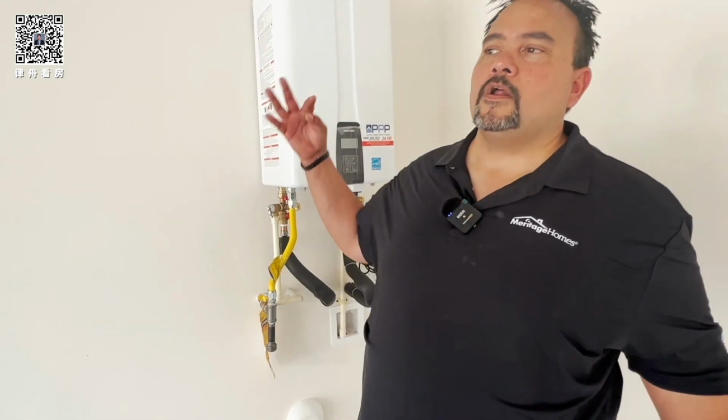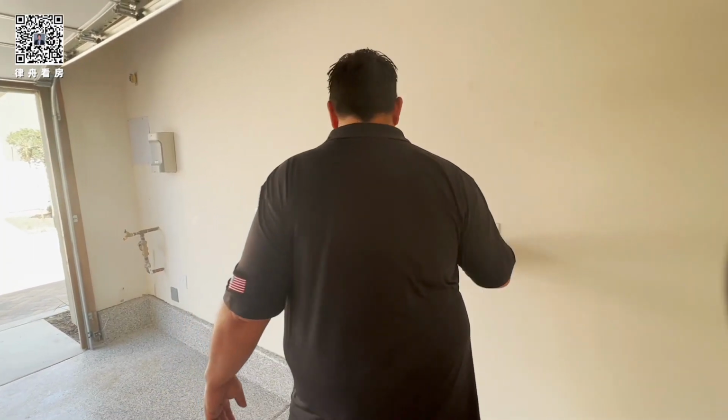So you want to check with the city. The homeowner just installed it anywhere? Yeah. So if you go to Home Depot here in Ontario, they don't say. Ask them if you're allowed water softeners, salt-based water softeners in Ontario. Environmental. Some cities don't want all the salt water going back in the system because then it's harder for them to purify the water.